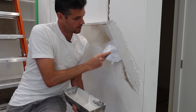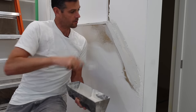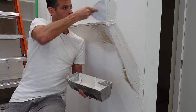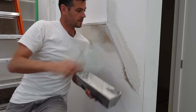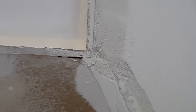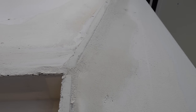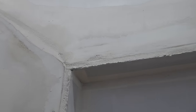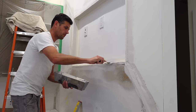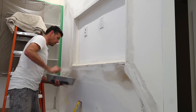It's not as strong as it otherwise would have been if it was boarded perfectly, but once we have all the quick set and the new beads on it should be okay. This isn't actually as bad as it looks — I just have to smooth it out so I can put tape on. I don't even want to fill everything here because I actually want it to be kind of low so that my angled corner bead — the no coat — sticks really nicely, and we don't have big voids underneath like there was. Even just seeing it all pre-filled makes such a big difference. What I'm worried about is this line — the high spot on the board isn't coming anywhere near that corner.